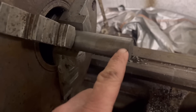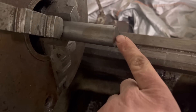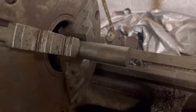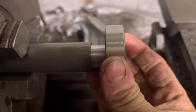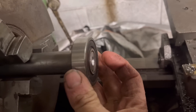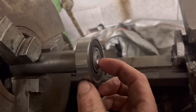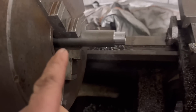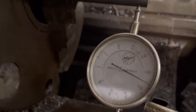We've got a round bar in the lathe now. I'm going to turn this end down to 20mm so a bearing can fit onto it, and I'll center it as well, and then I'll turn it round and machine the other end down, and then I can try and cut the thread onto it. That end is done — that bearing fits on there nicely. When I've finished I'll drill and tap that, and that'll be what holds the bearing on. I'll turn this round now and machine the other end down; when I swap it round I'll screw it up again and make sure it's nice and true.